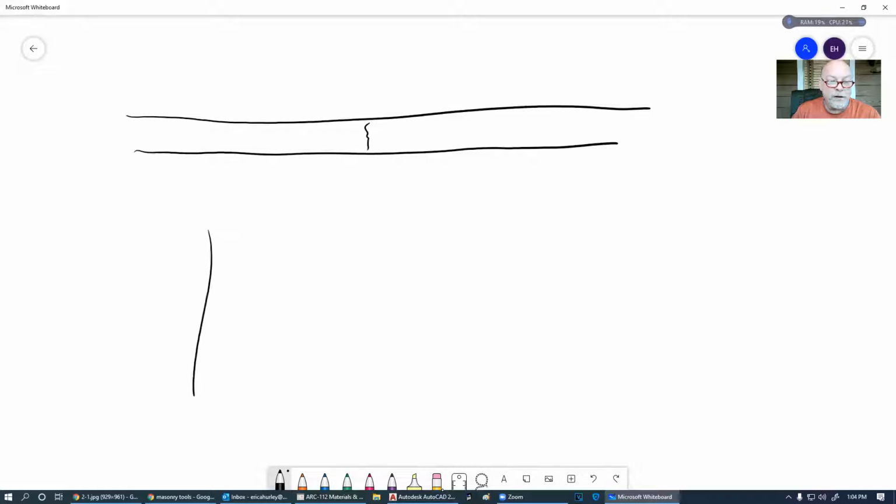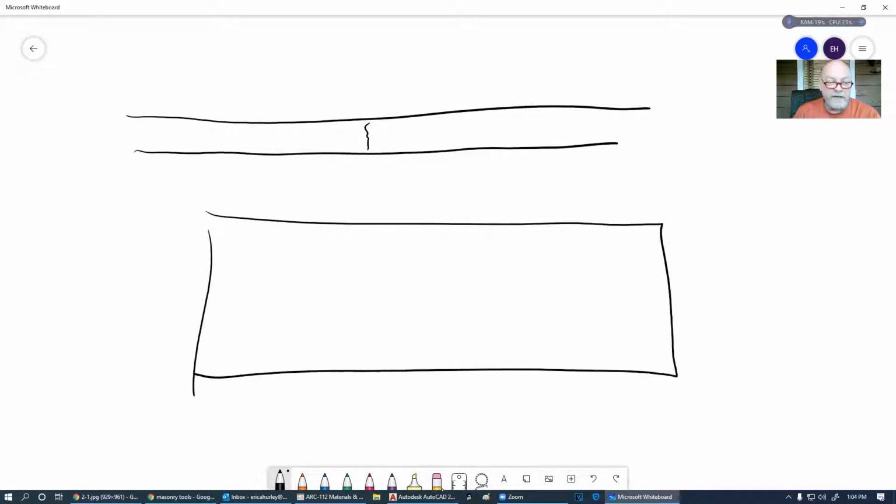Then there's going to be a crack. I mean, you've looked all over the sidewalks and stuff, and old cracks just run wild across and look ugly. We don't want that to happen. So what we do is we either put in a saw cut or a troweled joint to make a weak point in it so that the crack runs directly along that. Basically, we're taking away this free-for-all crack and allowing a crack to go in a straight line.